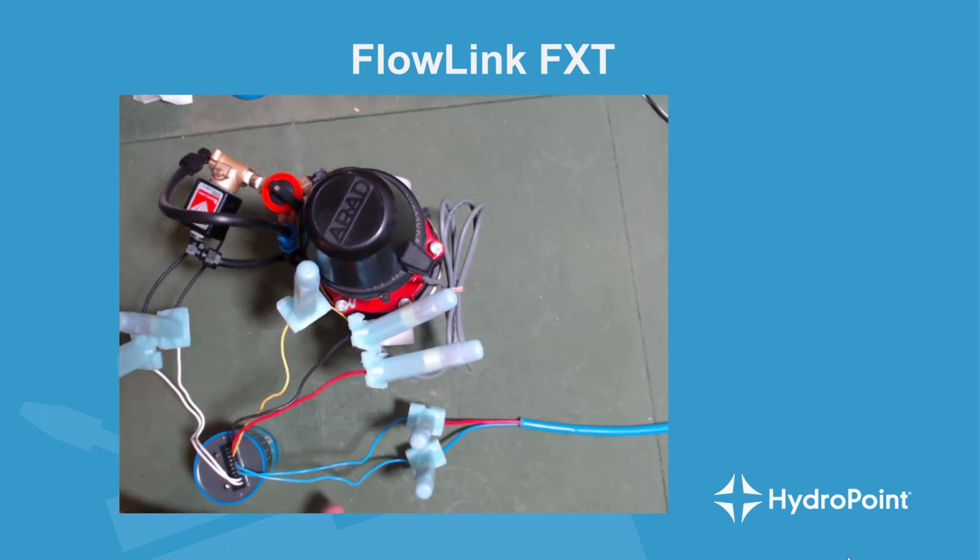Again, once you have the blue wires connected to the power supply wires coming from our FXT, our white wires connected to the black master valve solenoid wires, the red to the translucent, the black to the bare copper, and the yellow to the yellow wire for the photodiode, our photodiode is completely wired up. Just remember that the photodiode is the only application where that yellow wire on the FXT is actually used. In all other applications, the yellow wire is just left sealed up and not connected to anything.